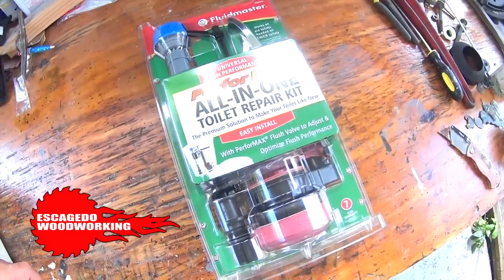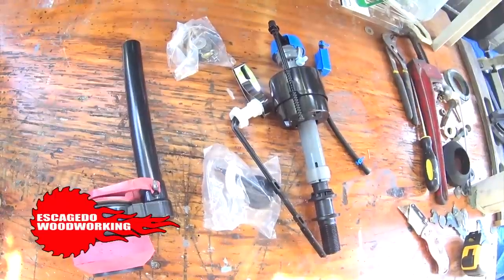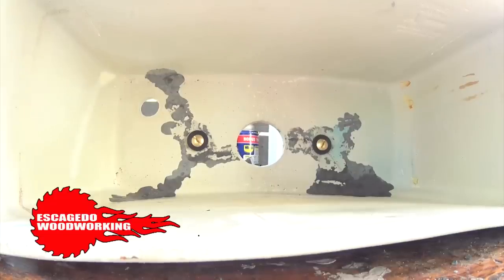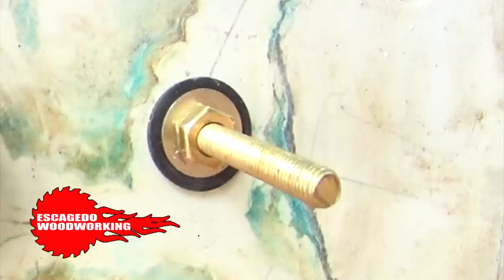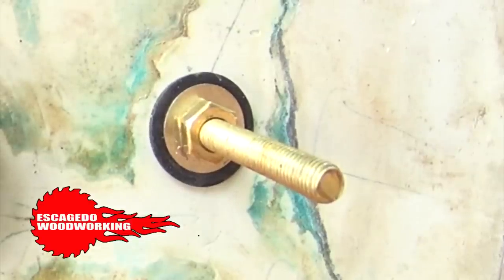Here's the kit I'm using — let's open this up. I'll leave a link so you can look it up. Here are all the parts included. I've added the bolts and washers already. Notice that the inside washers do not require a metal washer — a large brass bolt head will do the job. The bottom washer takes both a rubber and metal washer; make sure the rubber is what makes contact with the tank and not the metal washer.